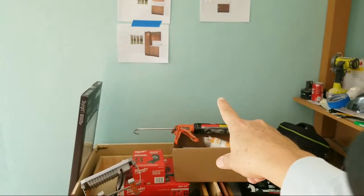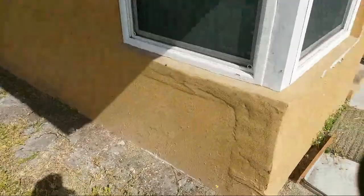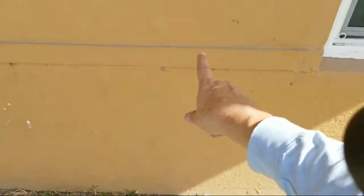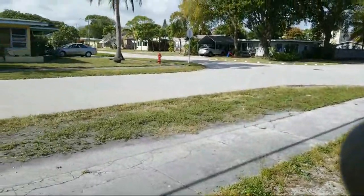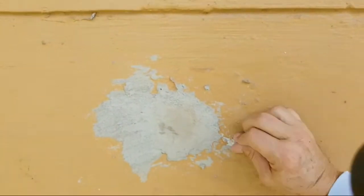We are going to add another outlet over here on the wall above this counter. For that we come outside the building — we're going to run it from the laundry room, probably run conduit under that front door and around the bottom of the house right at the foundation and come right up to about here. That's what most people in this area do — that's how they wire their houses, because it's all brick wall and there's no other way to do it. We also patched up this hole on Saturday — that came out good.